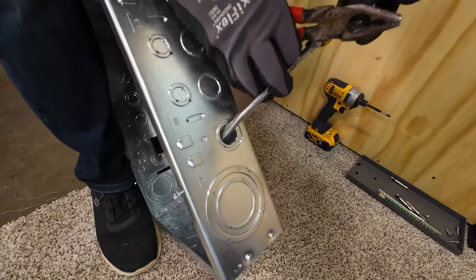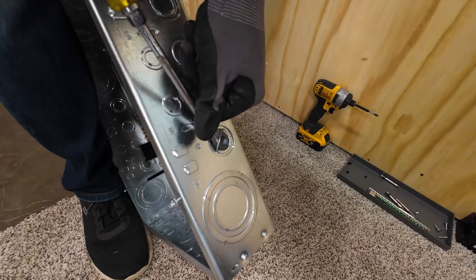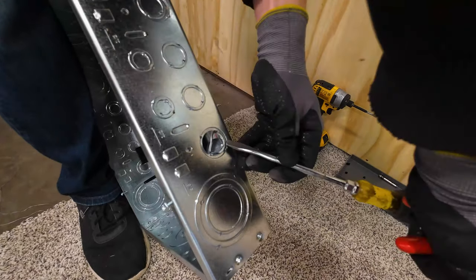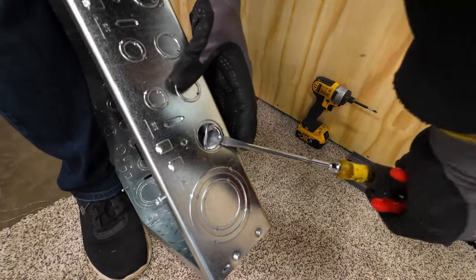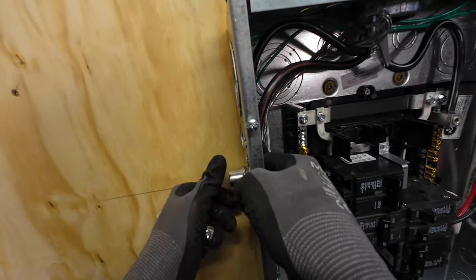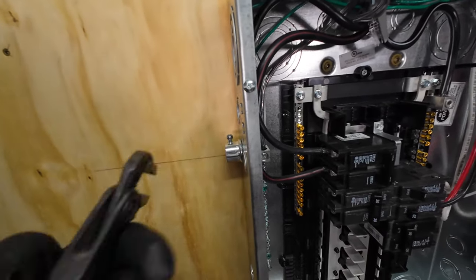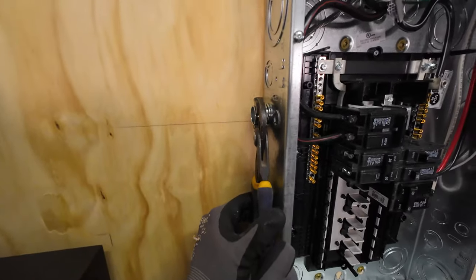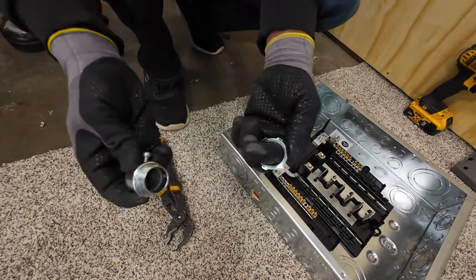There goes my half. Come back, nice and easy, try to just pull out that three-quarter. Some knockouts are practically drill-outs, they're so tough — just got to put the ear protection on them and wail on them with a four pound sledge. But some knockouts are more tenuous and you've got to be genteel, slow and patient. Tool tight, wrench tight — bring it to 90, put the channel locks on there and gently, slowly bring it home to perpendicular.